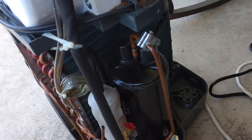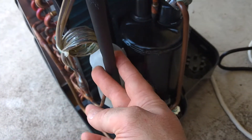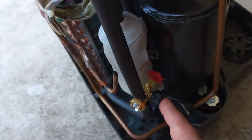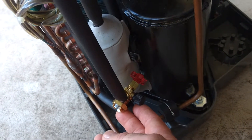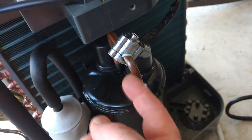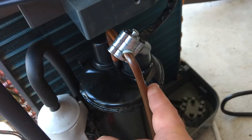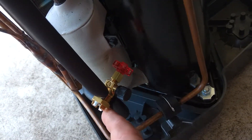Then when you fill it, the one you're wanting is the one that's insulated — this is your low line. So I bought another one and put this on. This is a better quality unit I got at Amazon. This one probably works fine if you put it on the correct low side, but since it was leaking all out around it I didn't want to use it, so I bought a better one. Those are like five or six bucks and this one was like $20 but it's much better made.